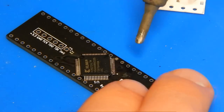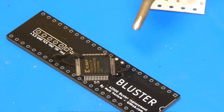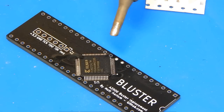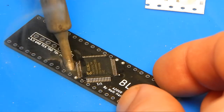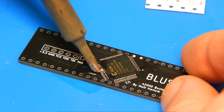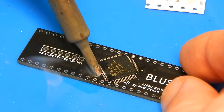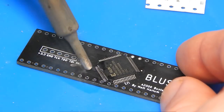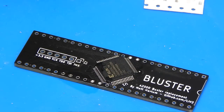I think I need just a tiny bit more solder. I've blocked a couple of those holes given their proximity — I fully expected that. Maybe some high temperature masking tape over those holes would have protected them, but it's no big deal. I can always use the desoldering station to clear them. I've bridged quite a few pins — just too much solder on the iron — but I've cleaned the tip and it's just a matter of working along with a bit more flux. I think that side is done. I'll do the other two sides then use magnification for a closer look.